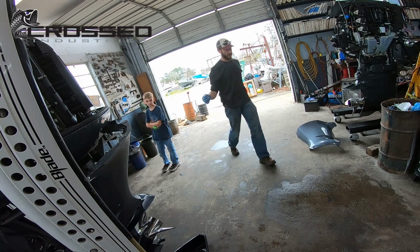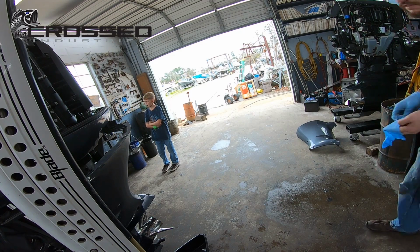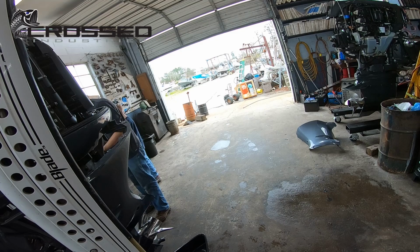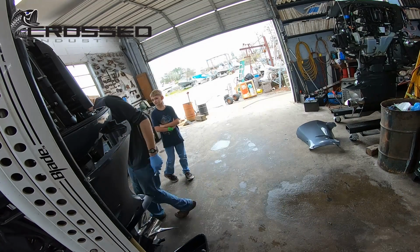What I like to do is, when I'm done servicing the motor, so I tear apart, I take an air compressor, put it at lower pressure, and spray everything down to get any gunk that's wedged up under there, then spray some anti-corrosion on some things. Yeah. Just to get a little extra level. No matter how you play it out, if you drain the Yamaha oil from anywhere other than sucking it out, that would make a mess.